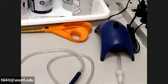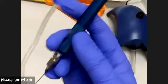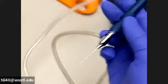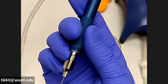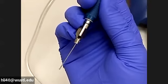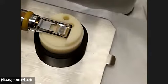So now we need to take out the washers. We have a pump here. If you see, this is our pump, okay? To use the pump, you press the button on the pump, okay? It's a kind of suction. So turn on the pump. It has a hole here. If you hold this hole, it will suck things up. If you release, it will drop it, okay? I'm going to show you, okay?